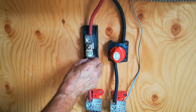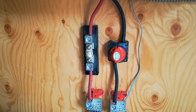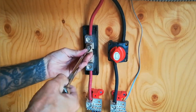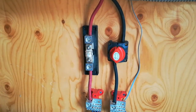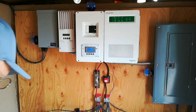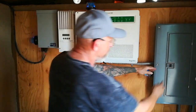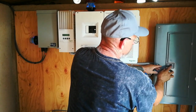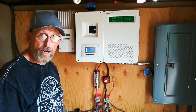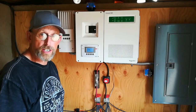Now replacing the fuse. This is the whole point of this project — to avoid having to remove the fuse every time I want to work on the system. In the future I'll be able to use the battery disconnect switch. Okay, so the switch is installed. I've thrown the breakers on — forgot to get the 60 volt, 60 amp, but now all the breakers are on and everything's working as it should. Now in the future, if I ever want to disconnect the batteries from the inverter, I'll just rotate this switch. If you have any questions, let me know. Thanks again for watching, and I'll catch you in the next video.